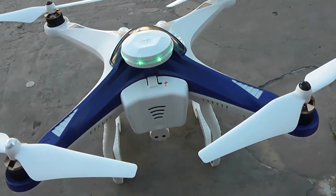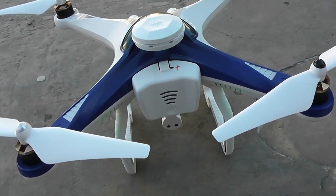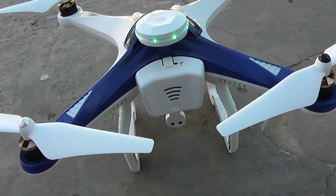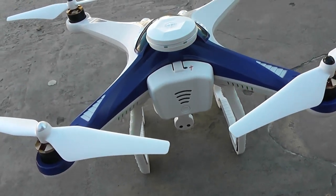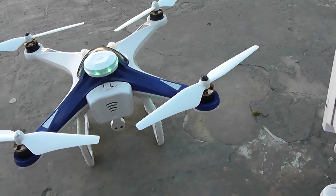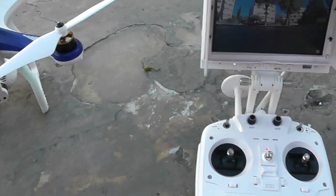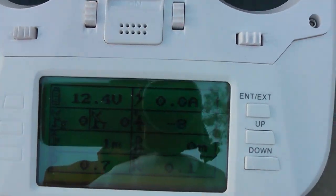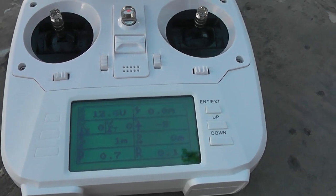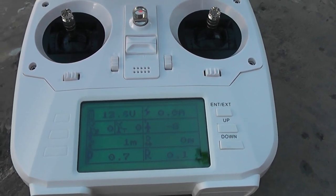So I managed to fix the battery by bypassing the electronic board controlling the power. I directly soldered on the LiPo pins, and I already did the compass calibration as well as the gyroscope one. So now I'm waiting to receive my first satellites. It will probably take 2 or 3 minutes to fix satellites.